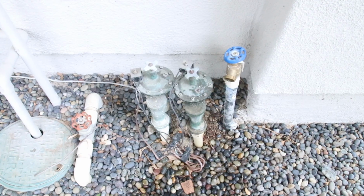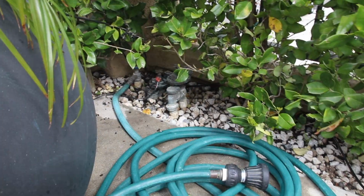So here we are, we're at a house. This is an irrigation call. We have a house with 4 zones. One zone, they're saying that they have a lot less pressure. We dialed up the solenoid. Again, there seems to be nothing there, so we're considering that we have a break from the solenoid to these lines, possibly under the grassy area, possibly under the concrete.